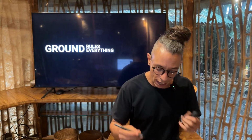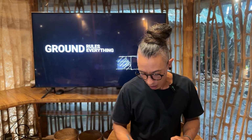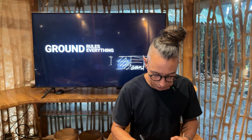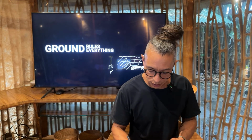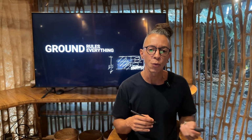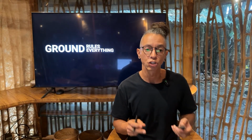So what you would like to do, imagine in a section you will have the floor here, and then you want to go deep 50 centimeters. Let's think that you will divide, and all of this is soil. You want to see some layers in the soil, how they behave, how they perform. If you start digging here 50 centimeters, then the ideal thing is that you hit solid rock here. Then you will see that the rest of the layers are getting softer. The important thing is that if it crumbles or if it's filling with water, then you will need to work on a better base or a different foundation type. So the best way is just to go and find solid rock.